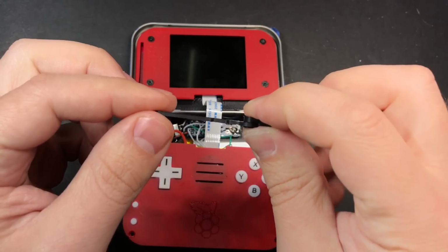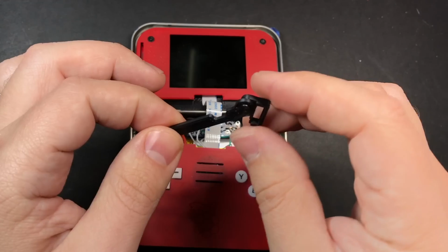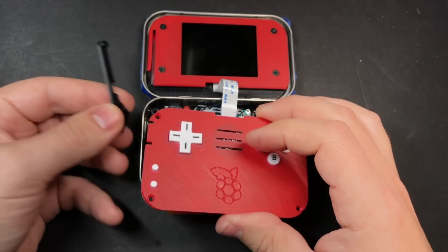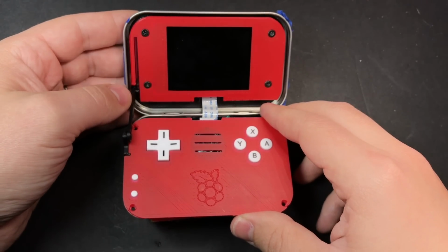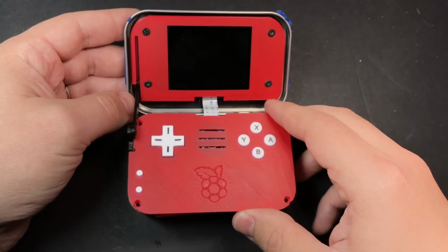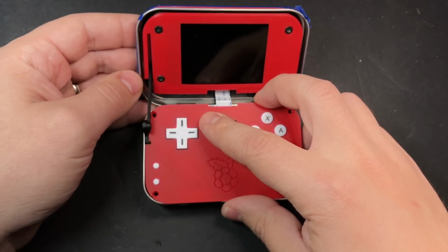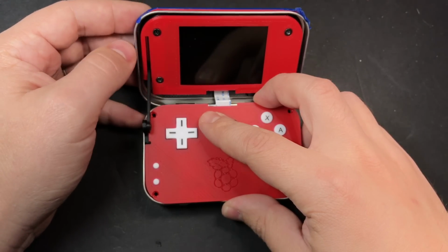And I know it looks pretty fragile, but depending on what material you print it out of, which this is a polycarbonate blend from Push Plastic, it's actually pretty tough. So the hinge snaps on right here. Then the arm inserts into there. So then as it opens and closes, it moves up and down along this slot here.